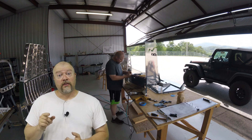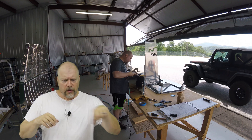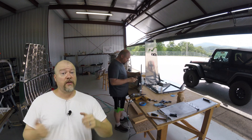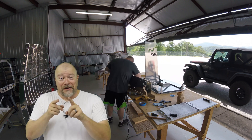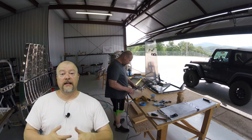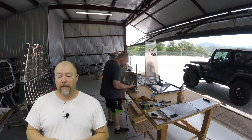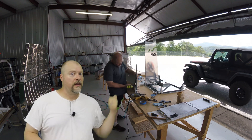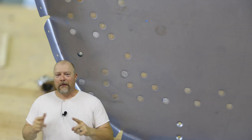There was also a place where I had used a blind rivet because it was a funky area to reach. I have since drilled that blind rivet out and used a bigger, beefier rivet from the other side. I had much easier access once I got my head out of using a back rivet plate, and that all came together. You can see in the picture that none of those rivets are blind rivets — so that works too.